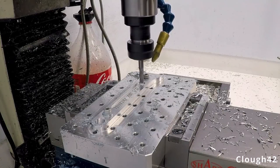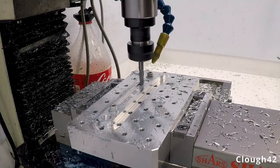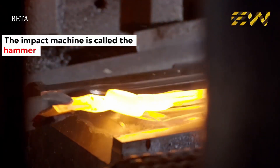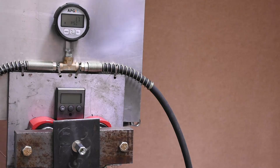If one is machining the part from bar, you've got to realize that in that bar stock there will be longitudinal grain structure from rolling that bar or even the plate through the rolling process. When you go and take that raw material and start to machine away everything you don't need, you're actually going to be cutting through that grain flow. If you start with a forging, you take that bar, you reform that flow, you reform all that microstructure so it follows the contour of the part, so that when you come back and machine, you're not machining through that structure in a way that would potentially weaken the part.